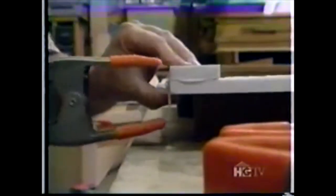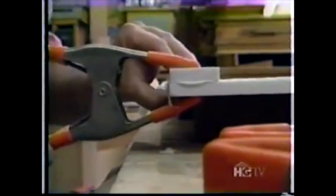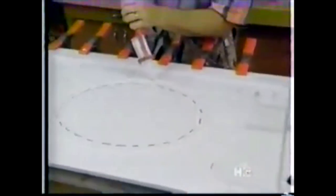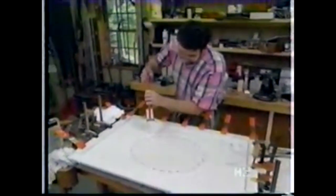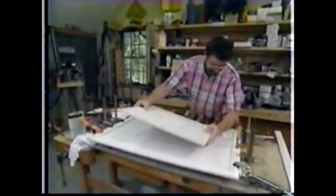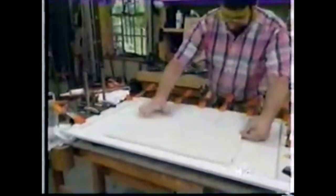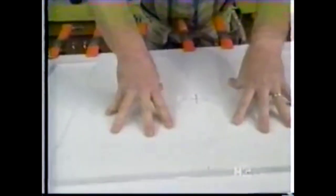All right, now they call for spring clamps about every 2 or 3 inches to hold the pieces together. Here in the middle, I'm going to use one big piece to double it up rather than use smaller pieces to piece it in. Now this square piece, you'll notice I drilled a couple holes in the center. And that's to let the air out as I squeeze the 2 pieces together so there's no voids.